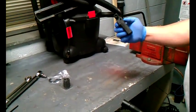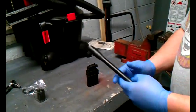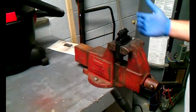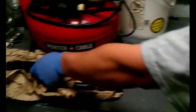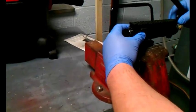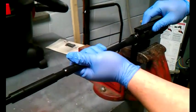What we've got here today is the bed block, and we're going to show you how to install an AR-15 barrel onto an AR-15 upper. What you're going to do is lock this into a vise, preferably a bench vise. You're going to take your upper and put it on top of this right here, then slide your barrel into the bed block.